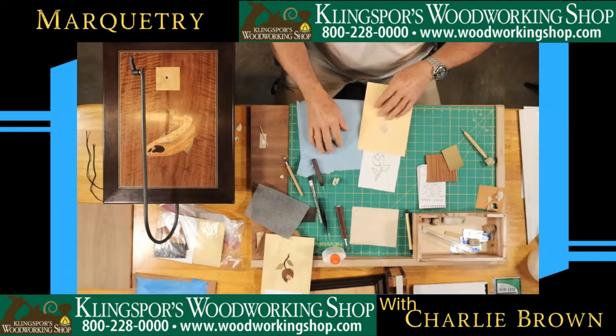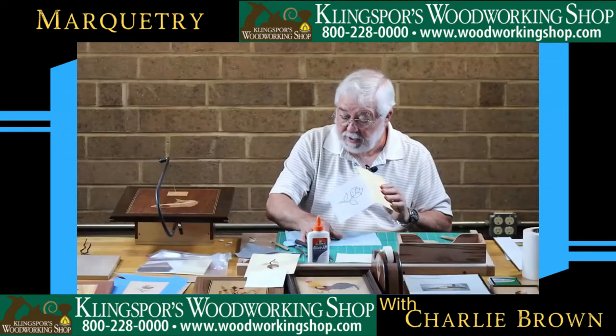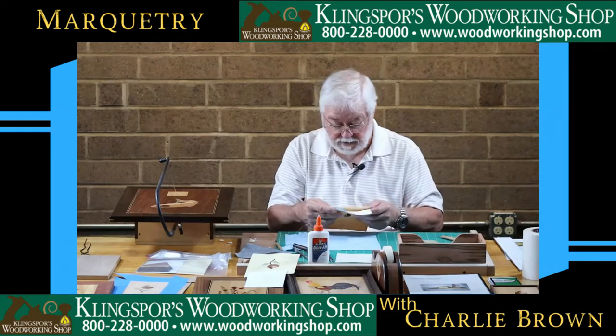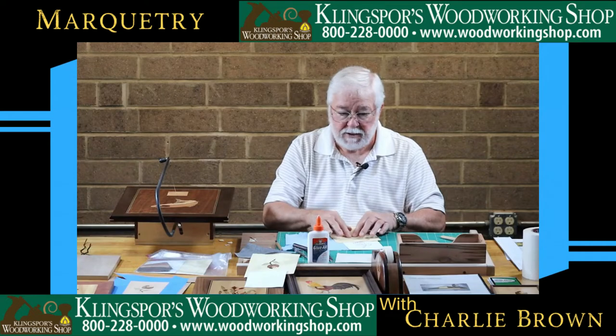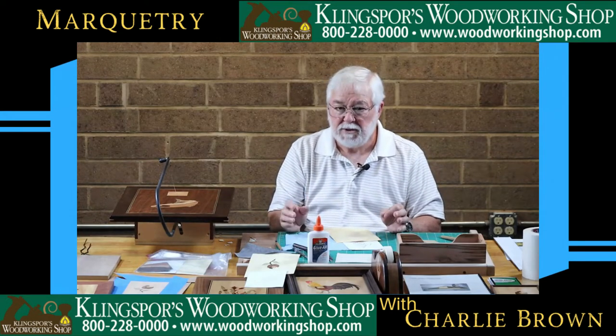talk about procedures. You're going to find that the older veneers are much thicker than the newer veneers because of the process they use to cut the veneers now. So what you want to do is pick your veneers based on your preference as far as grain and color, but also pick veneers that have the same thickness.